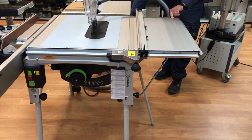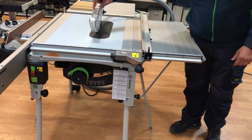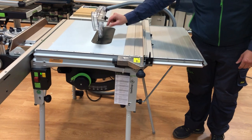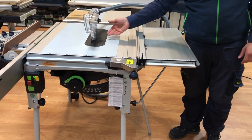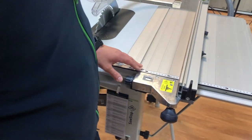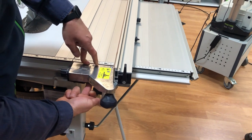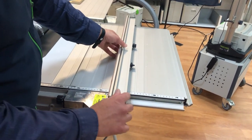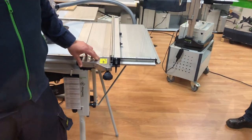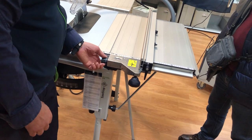The extra two degrees are obtained by unlocking the adjuster. It has two vacuum sources and dust collection appears to be quite effective. Keeping the tradition of Festool products, it also comes with a blade guard which is not only a vacuum source but an increased level of safety. The higher spec version also includes an awesome fence — the main knob tightens only the forward part, but with a simple push of a lever the back side of the fence locks square in place. It also has a micro adjustment knob, really great for those precision cuts — no more bumping the fence to move it just a hair.